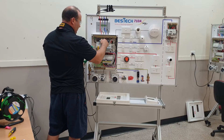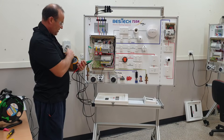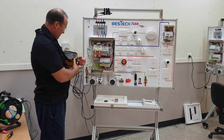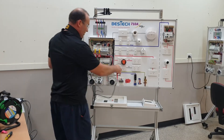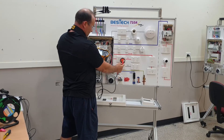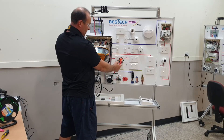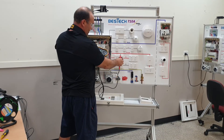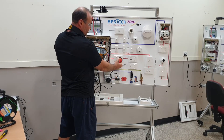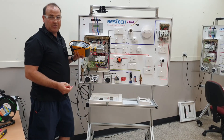You can see here we can connect it straight to the bus bar — the red bus bar, the neutral bar, and the earth bar — because they all come back to this one spot here. So now I'm going to connect that and I should get the same readings. If I go to my active, I think it was about 10.4 — here I've got about 10.8. So with the resistance of the circuit, that is definitely my active. Now if I go to the neutral — 5.4 — which, when we take into consideration the resistance of the circuit, that is definitely my neutral.